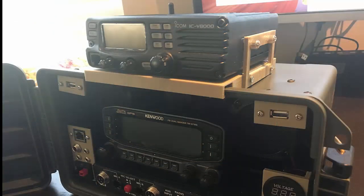Next, I'm going to look at what if I have the need for three radios. I may expand this in a future video where I'm going to make some type of tier system where another radio will sit on top of that ICOM radio in a temporary position, possibly with a little bit of height for air venting. This is a good solution when you need a second radio. It is a high-duty cycle radio, and so you want to give this plenty of room to breathe, especially if you are having to use it on high power. This is not a radio that you want to contain inside a box or a rack that is going to have limited airflow. So this is the perfect solution for this kind of radio to be able to be out in the open air.